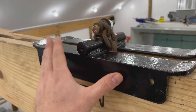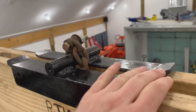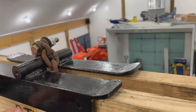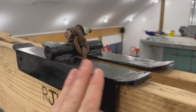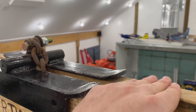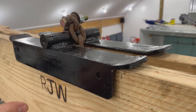The width of this plate helps spread out the load over a larger surface area. If you were just using a pin sitting on top of the wood, that puts all the stress in one spot, whereas with this angle iron — which is probably 3/16s angle iron — the load is spread across over a foot. That makes a big difference. It keeps the top of the beams from getting dented in from the pin, it also keeps it from twisting, and it does help spread the load across a wider surface area.